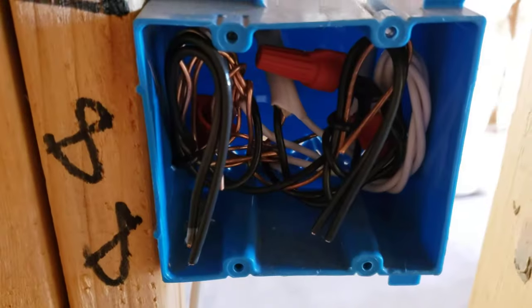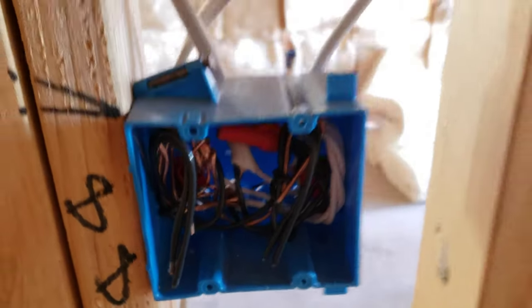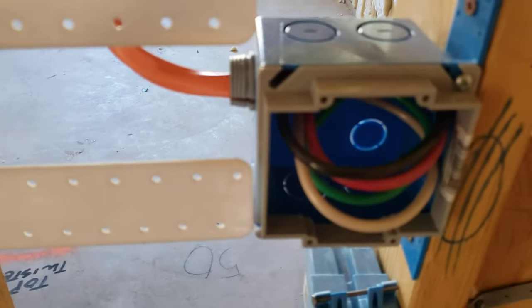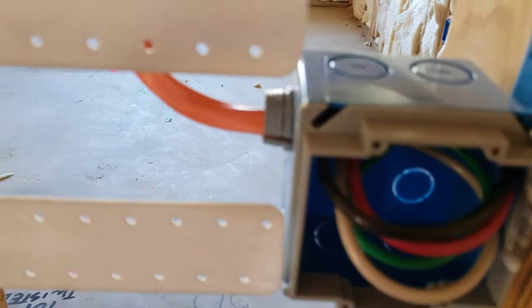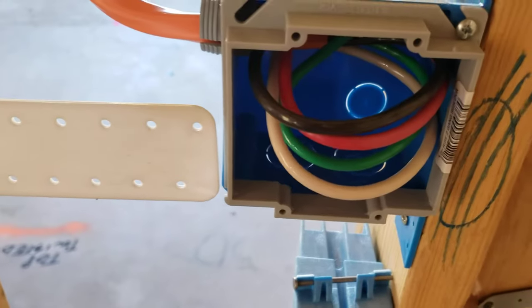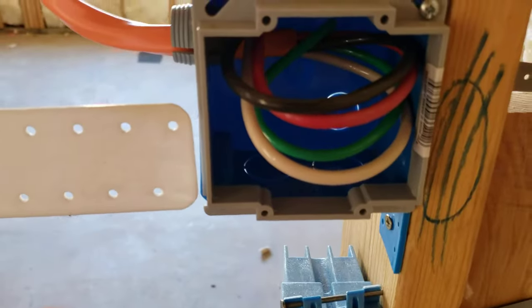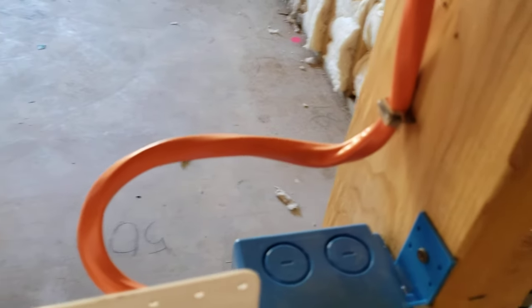How do you know you have this in your house? As you can see, you can hardly tell. The biggest giveaway is the size of the wires — they have to be upgraded one size versus what would be used for solid copper wiring. Here's a dryer circuit. There's the outlet if you were to use a gas dryer, but here's an electric dryer circuit and you can see it has an orange cable. Normally the dryer circuit is going to have 10 gauge copper wire and be good for 30 amps.